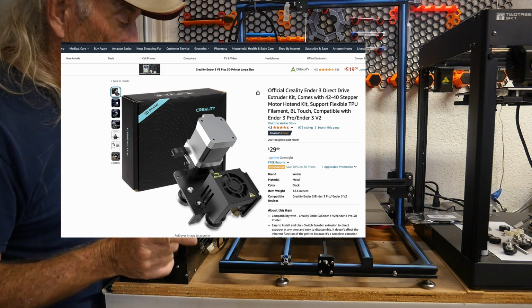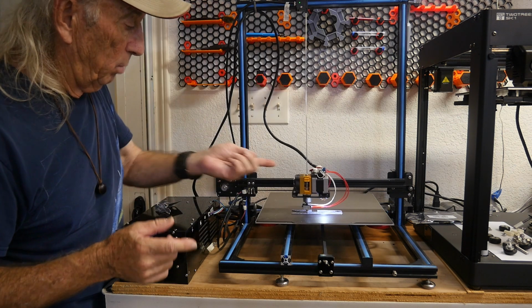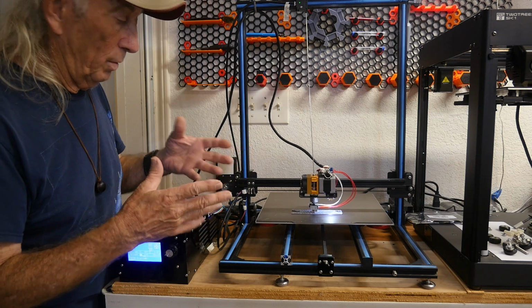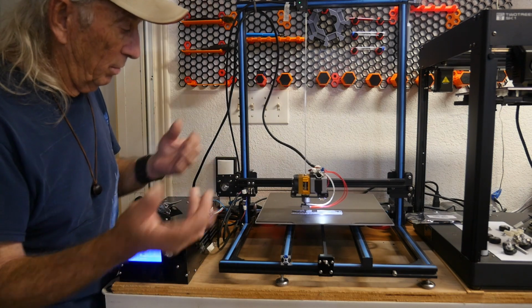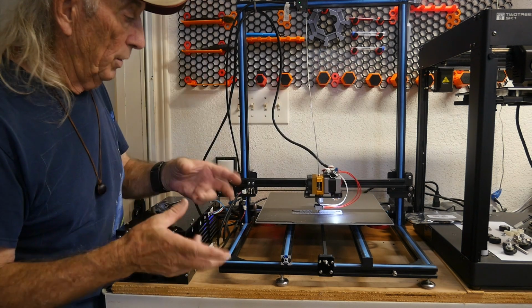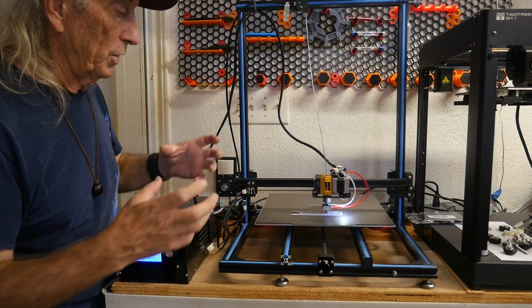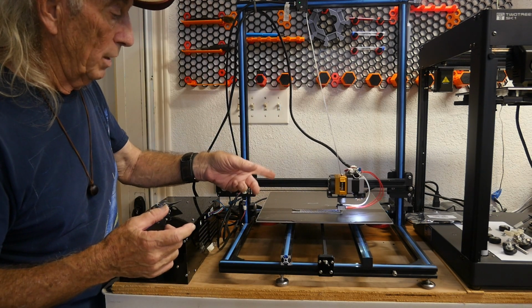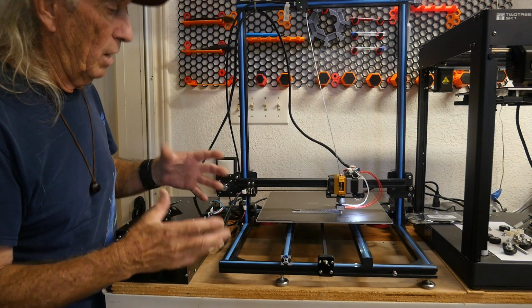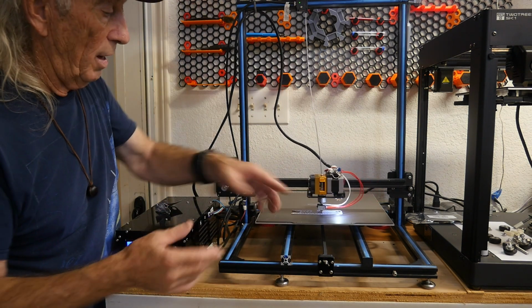What I added in the last 48 hours was a plate back here that has 4 wheels on it, and I'll show you a picture of that, and I'll give you a link below where you can find that plate. It's only about $9.50, but it's 4 wheels, so it's got a really good sturdy grab on the 20 by 20 aluminum here, so it's helping to keep all this from bouncing or shaking around, which is what it was doing. This thing here was just absolutely bouncing.